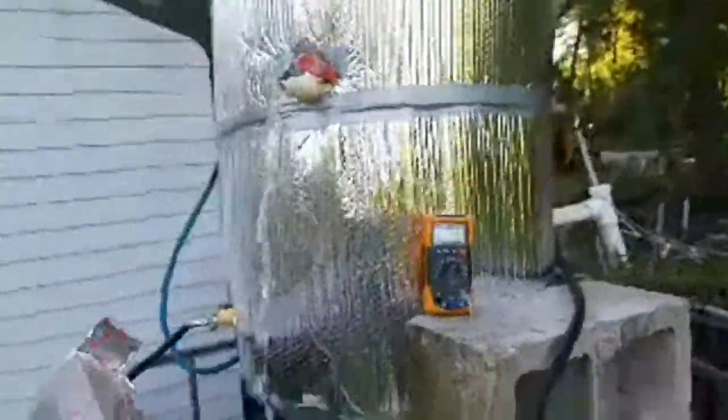So I think this is very successful. I think what we've demonstrated today is that a single handmade solar panel of 2 foot by 4 foot with 12 copper pipes, 5 foot length, battened down onto galvanized sheet, is enough to do heat transfer with plexiglass, the thinnest piece of Lexan, a 2 foot by 4 foot piece for $33, so about $66 in Lexan, UV protected, non-yellowing, unbreakable, warranted, which is pretty flexible, using 3M tape to bind it to a 1x4 and a 2x4 and some foam insulation in the back with some galvanized roofing material holding the foam insulation so a single person can carry the panel as I did,